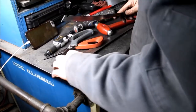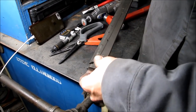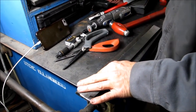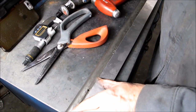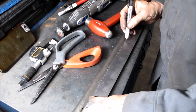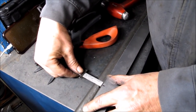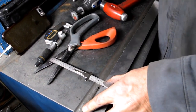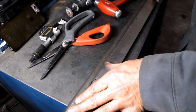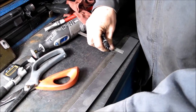Double check it again. We are right there for our groove, so that's good. Now we will check and measure for our oil — you can see the oil slots — so just lay it on top and mark your shim with your Sharpie. The hole is right there, right there to there, and then there to there. Measure with your scale how far you are — we are at 16. Then do the same thing on the other side.